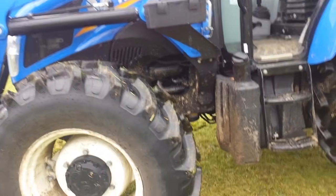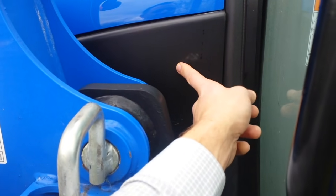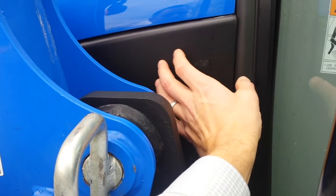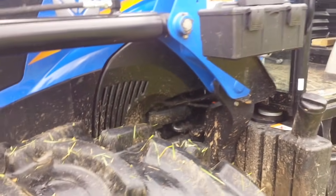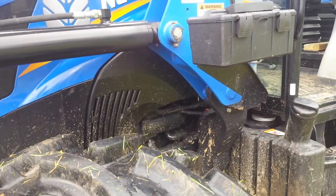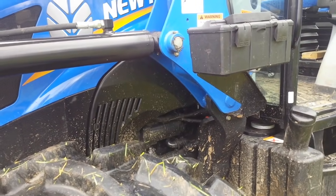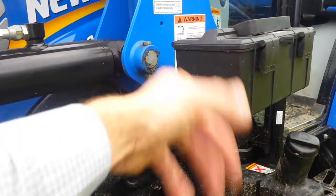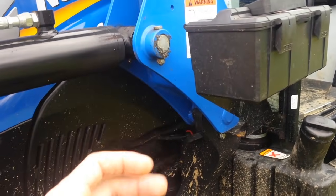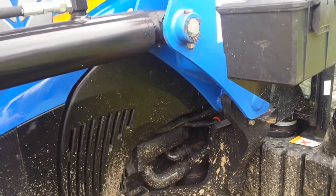There's a nice filter that's easy to get at, but the engine oil filter is located behind a panel, and there's also a bracket in the way once you get behind it. This tractor has a 600-hour interval on the engine oil, but since I don't put many hours on it, I like to change it annually. I'd recommend dropping the fuel filters at the same time — they're behind the same panel. You'll want to fill the new fuel filters up before installing them, as it won't prime itself with that volume required.